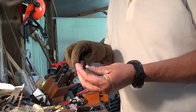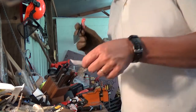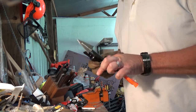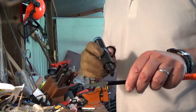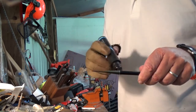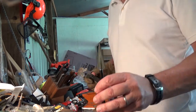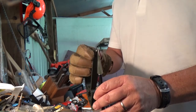I may have to prep this because the bevel may be too narrow on it. That sliced a little better — that went through about a quarter of an inch. What you can do with these is make sure that it's getting all the way down in the notch and you're not just sharpening the shoulders of the bevel instead of the blade of the bevel. Just blacken them with a big fat tip marker, totally blacken them out. Make sure the very edge is black. Then run this down eight or ten times and look at the edge to see what it looks like — make sure it's getting the edge with the bevel and not the shoulders of the bevel.